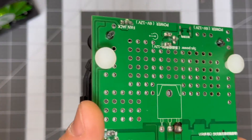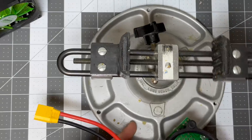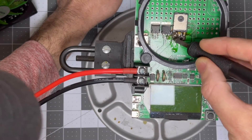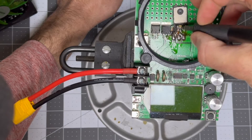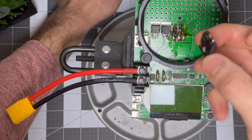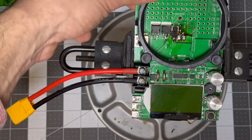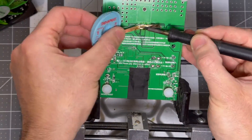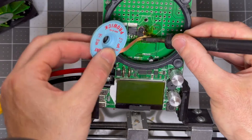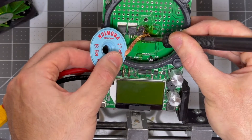It's going to be difficult. The whole thing is designed to dissipate heat, so I think I'll blow air on the back while I use my hot soldering tip on the front. The MOSFET is actually coming off pretty easily. The legs were actually fried — I think they were broken on all three because they all three bend and go through the board. It can be really challenging to remove solder on boards like this that are built for heat dissipation, because your soldering iron really has to heat up the whole board before it can melt the solder.